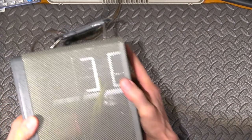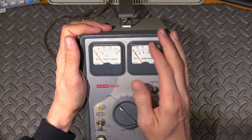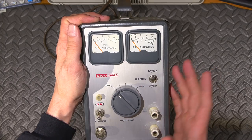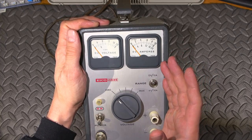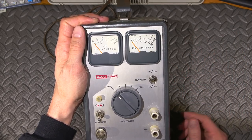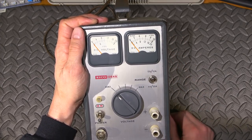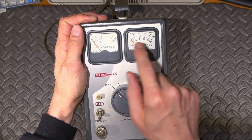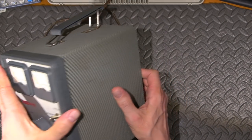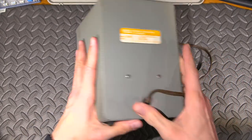It's quite a heavy power supply - lots and lots of weight to it. As covered in the previous video, it has a 0 to 6 volt scale and a 0 to 12 volt scale. Since it's not regulated, there's a lot of overshoot - they're taking into account that this is going to be loaded. It's rated at 10 amps at 12 volts and 20 amps at 6 volts. You have the amp meter and volt meter right here, and again, you're the regulator.